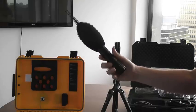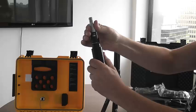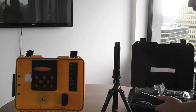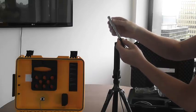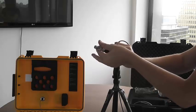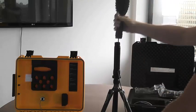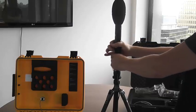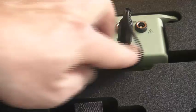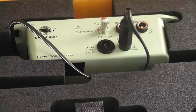Connecting the cable to the mic requires partial disassembly of the unit. These parts are snap lock and easy to take apart — simply twist and remove them to gain access to the cable sockets. It should attach with a noticeable click, and then you can reassemble the microphone unit. Tighten all parts firmly. Once all cables are properly connected, you can then turn on the power unit. This starts the modem and router and the 2250 Noise Monitor, and at this stage you should get an OK message from the noise monitor.